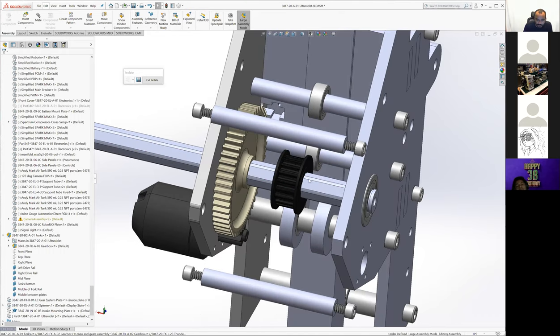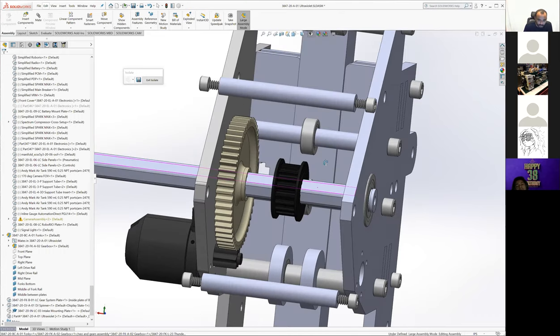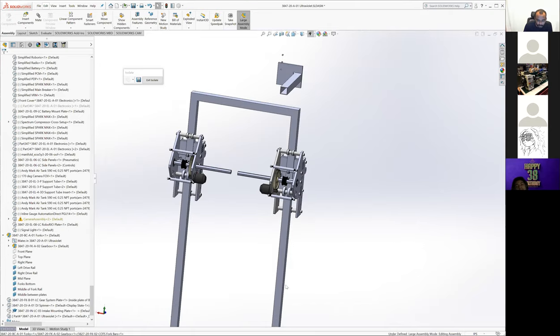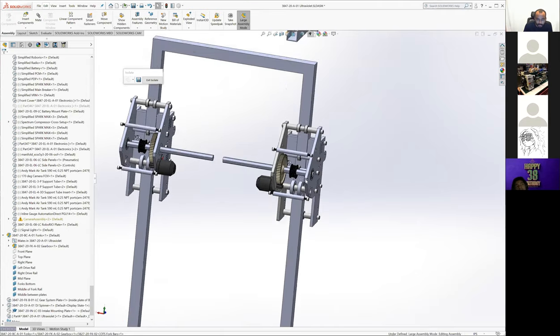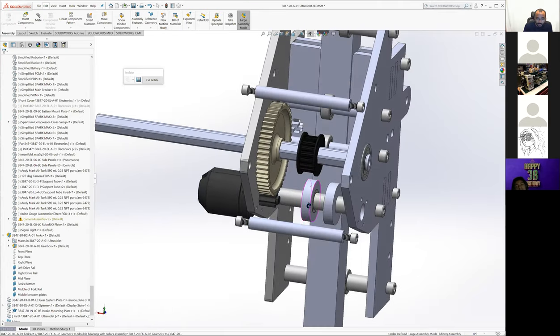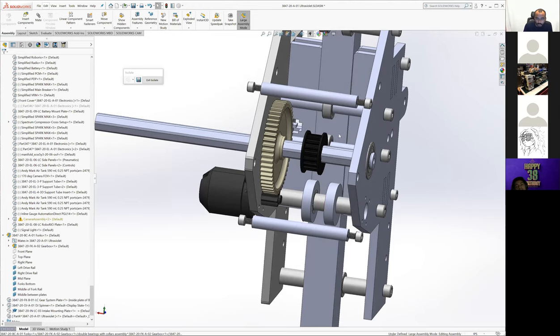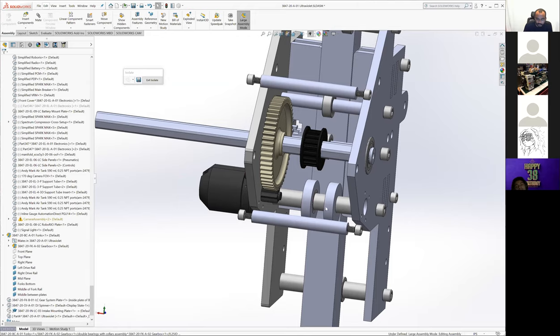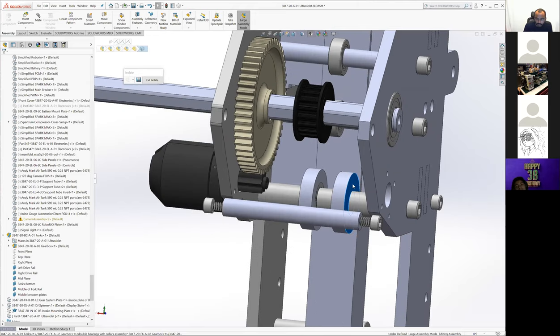Do you want to explain some of what the bearings were doing and how that worked? Sure. The belt ran along the forks, and then it went down in almost a snake motion, going underneath and over some of the bearings, over the pulley, and then back underneath those two. These were two 3D printed parts with bearings inside. They were just press fit.